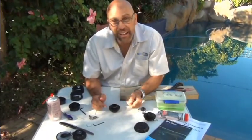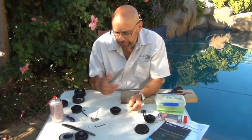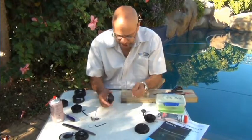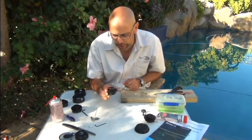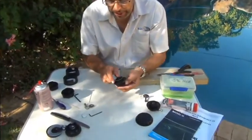There is another o-ring on both these valves — the swivel o-ring — and that doesn't tend to give problems. They're a bit harder to get to. I can show you on the Apex one how you'd get to that. You can see there's the swivel, so there's got to be an o-ring inside there.